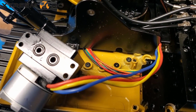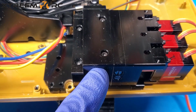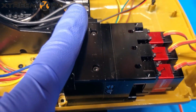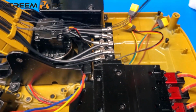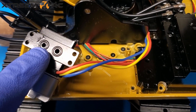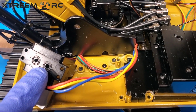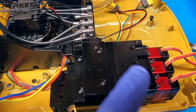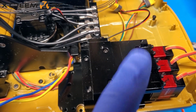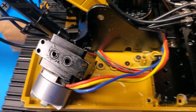That's really the business end there. Those 2 are made up with those, and then underneath this flat plate, they come back up, and then these servos here will open or close to let fluid go to the hoses, which in turn make the things move. So there you go. If you're going to have a leak, you might have one here. There's 2 O-rings, keep that in mind. There's O-rings here. All right, and there's also O-rings we'll show later inside this block here for each of the valves. There's O-rings, so we've got to be very careful with those. And yeah, there we go.